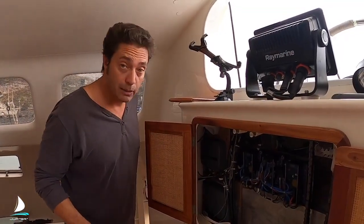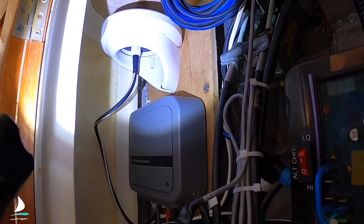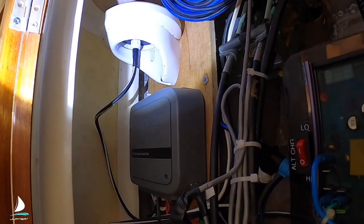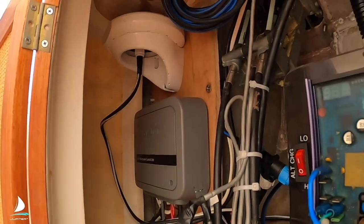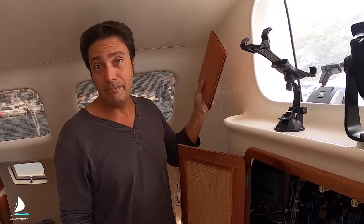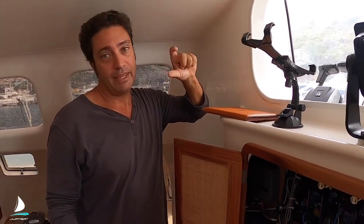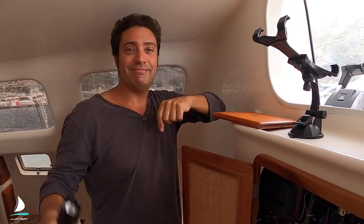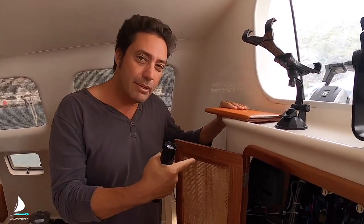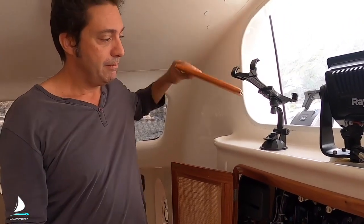Here's a lesson I learned the hard way. The EV1 sensor - this little flying saucer - should be one meter away from any electrics or anything that may influence it. I found that the iPad, which has metal circuit boards, was probably only that far from the sensor and suddenly the autopilot would go haywire. So that's in a bad position. Now I'm aware of it I'll keep that under control - I can't put my iPad there, but up higher is okay.